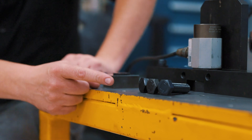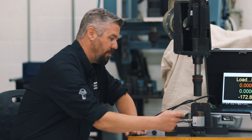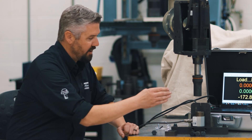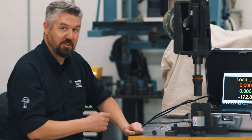So we've got these three bolt grades: 8.8, 10.9, and 12.9. The property class of a metric bolt tells us about its ultimate tensile strength. We're going to test them out on this fixture and see how much clamping force they generate when we take the bolt all the way to failure. Let's check it out.